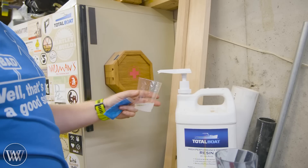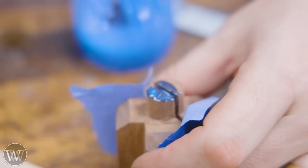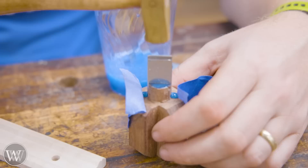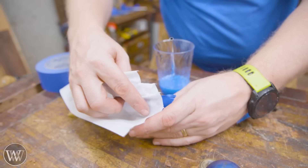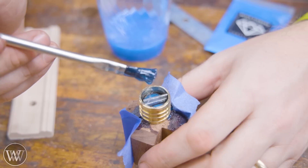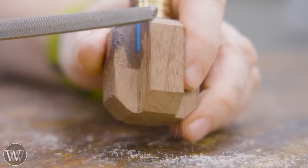I'm going to use Total Boat High Performance as the epoxy. Do I need something structural and powerful like this? No, but I have it on hand, and once you get epoxy it's kind of an investment — those jugs will last you a long time for the average woodworker. I'm going to mix in a little bit of dye to fill this in, and I ended up putting way too much in — it's spilling out all over the place. I like the blue dye, and I put some tape into the corners to try to mitigate that. The more I tap the collar down, the more epoxy comes up the sides because I put in way too much, so it starts smearing and dripping everywhere. But epoxy scrapes off very easily afterwards. For the collar, I want to make sure there's enough epoxy until it goes in, then add a little more to the top so it soaks down around the collar and gives a nice surface inside. I'll let it sit overnight and come back and clean it all up.